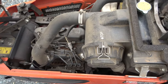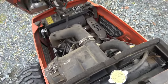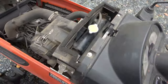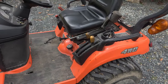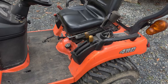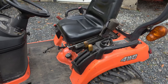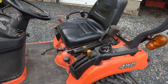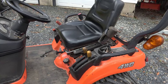In all its glory, here is the little three-cylinder engine — the engine that could. There's been nothing really to report here; I've had to do regular maintenance on it. The only two problems this tractor has had: the first is a fuel starvation issue. There's an elbow down in the fuel tank, and trash in the diesel plugged right at that little L. By the book it would have taken about 14 hours to fix — you have to take everything off. I was able to cheat and vacuum it out through the bottom side, which I'm glad worked.